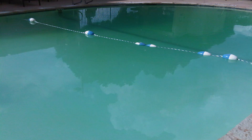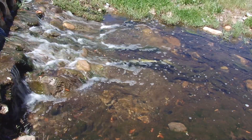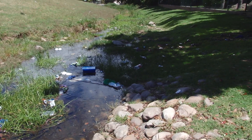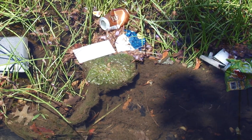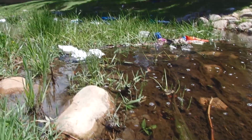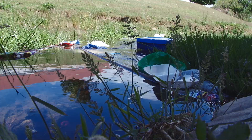If your water has a hazy look, the cause is usually suspended particles in the water. Treatment is to filter the water through a filtration system to get clear, colorless water. If there's a polluted stream nearby, you may get a bad taste or odor from your groundwater. This is usually caused by rotting particles, and the bad odor is caused by elevated levels of hydrogen sulfide, which is responsible for that terrible rotten egg smell. The best treatment is to clean the offending stream. Odor and taste problems can be cured by getting rid of the offending substance, and each case will need to be assessed and treated accordingly.